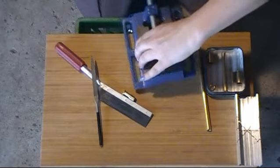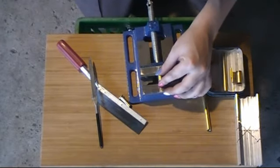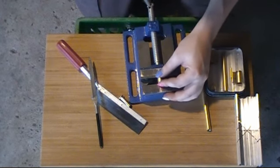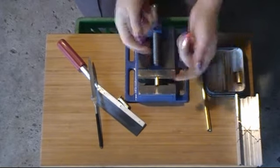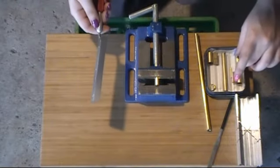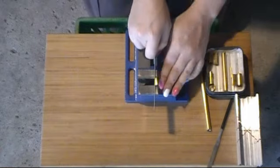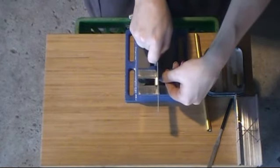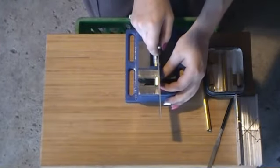You've got to saw this in half, not straight in half. You just got to split it on one end. That's surprisingly easy to do. Get that in your clamp there. Try not to damage it too much. Obviously you want it sticking up off the face of the clamp a little bit. Get your saw. I can use my thumbnail, but you just want to start on one side. You just want to get a little angled cut in on one edge, and then that'll guide you on your way through.